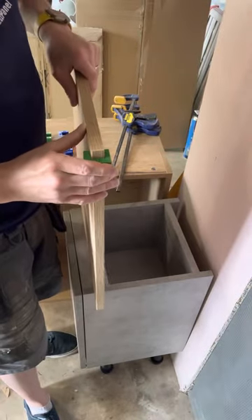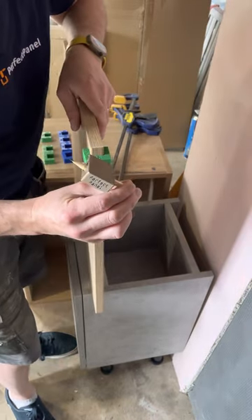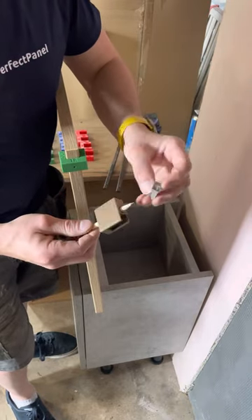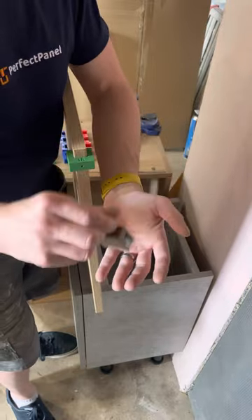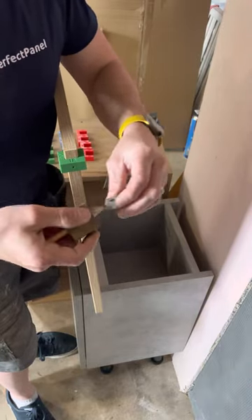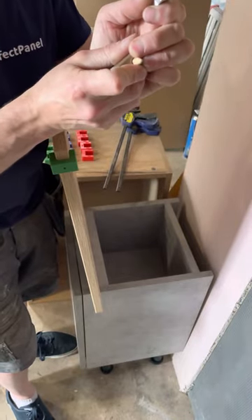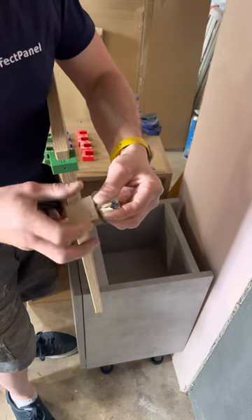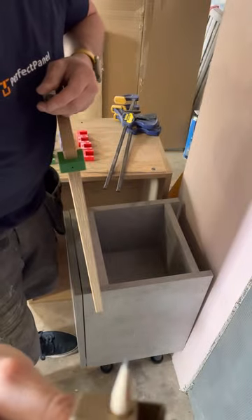The other thing we've done is we've now got the bronze scribing block. It's got a built-in pencil sharpener — you can either leave it in there, take your pencil out and sharpen it, it's a snug fit and won't fall out. Or you can take it out, sharpen your pencil, push it through a bit more. The pencil is a tight fit in here as well — very very sharp. It's better than using a knife because with a knife the point of your pencil is not in the centre.